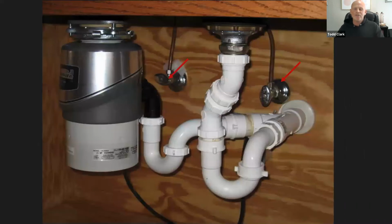Okay, here's an illustrated picture of underneath the sink. This is a kitchen sink. So we have our PVC pipe. As it comes down, I'll use my little cursor. So the water comes down the pipe, curves. Here's my trap. And if you tilt it to the side and you turn it clockwise, it's shaped like a P, like a printed P. And then it goes out behind and drains out.